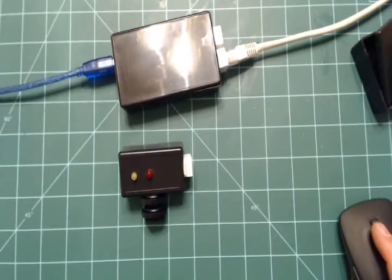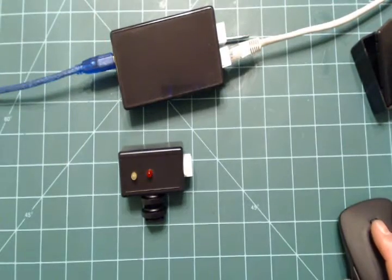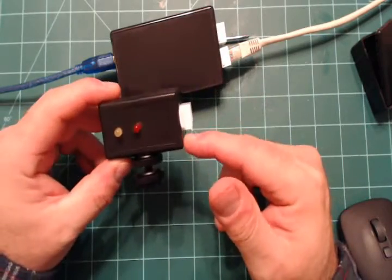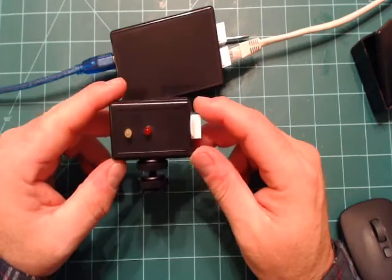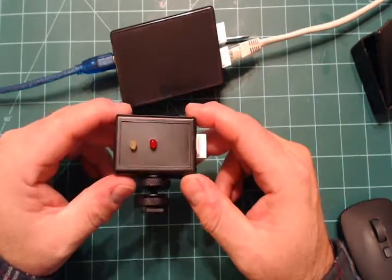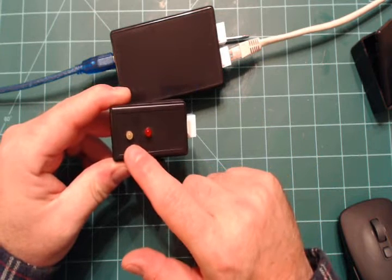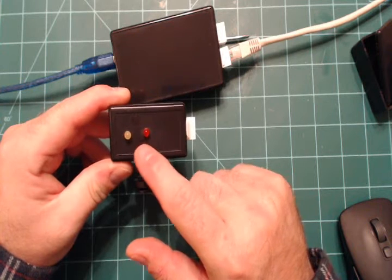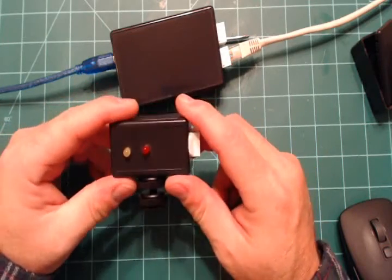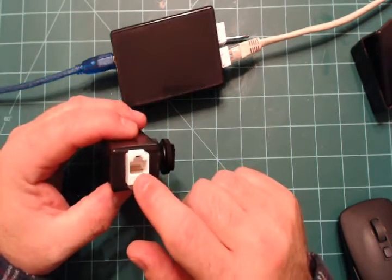Here we are on the home stretch. This is my tally light - my first build. This will be tally light number one, or it can be tally light number four, because they're both wired identically. Tally light number two and five get wired the same, and tally light number three and six are wired the same. I used red and yellow - yellow is the preview, red is live. I went with yellow because vMix uses yellow for preview, and red is kind of the standard.